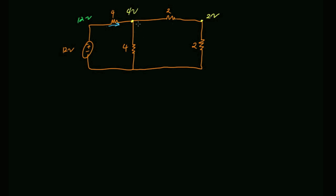I'm not saying it's inherently a bad thing if current gets drawn off. What I want you to be mindful of is that you can't just eyeball the circuit and say, yeah, 12, 4, 4, half — that's got to be 6. It doesn't work that way. You can't use that voltage divider equation unless you have the knowledge to recognize that it's not a voltage divider.